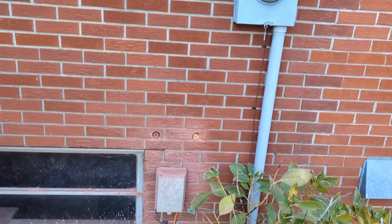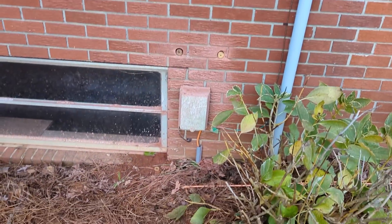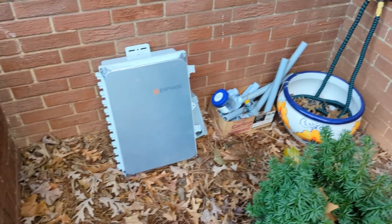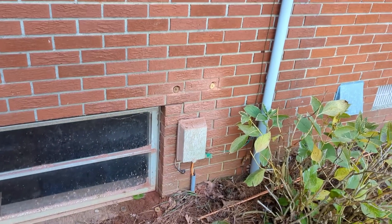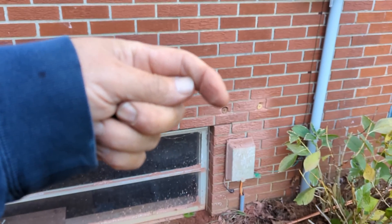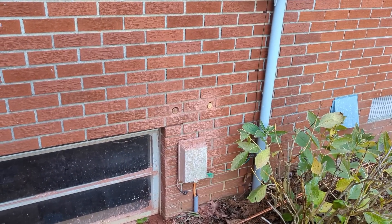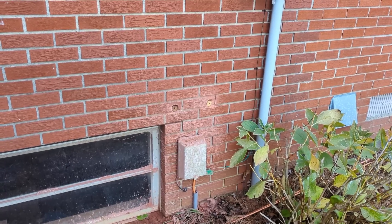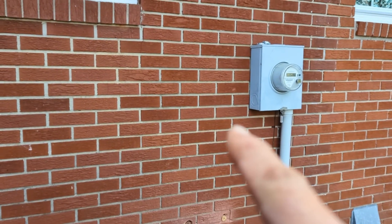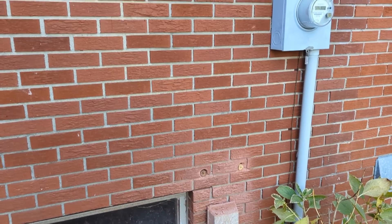Here's where we're going to mount the Enphase combiner and disconnect. I'm going to do one-inch PVC — already got the holes bored through the band, through the brick, and in the band. Love that core bit. There's the combiner, the disconnect, and whatever fittings we need to take the circuit from the solar array — bringing it down through the ceiling out into the combiner. I have some 8-3 Romex somewhere that'll come into the combiner, hit two breakers, combine the two circuits, then we'll have a number eight going to the disconnect and land on a 40-amp breaker.